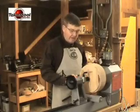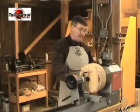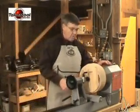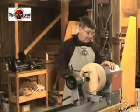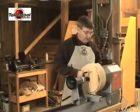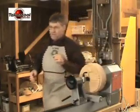Let's talk just a second about safety. Lathes are fairly safe — the main danger is too high a speed. So we are going to pick a speed of 500 RPMs, which is our default speed and a good, safe starting speed. We'll put anything that might drop on the floor out of the way, take off watches or rings. Safety glasses of course, and side shields are not bad to have. When we first start up the lathe, we stand out of the way so that if it flies out, nothing will happen. We see that we have a safe speed and we can now commence turning.